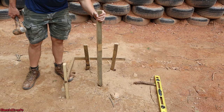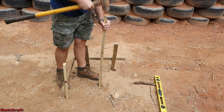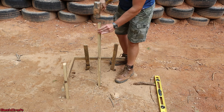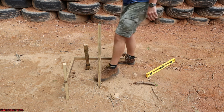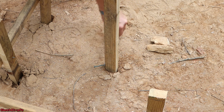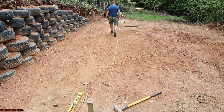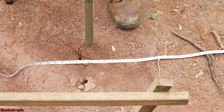Let's go ahead and make sure we have this building measured out and square. I know this spot right here is where I want this first corner because it is 16 feet away from my other building. This doesn't have to be too far in the ground as long as it stays in place while I get the string out. I put a screw on the diagonal of the front corner so I can use this to measure in both directions. Now let's take the tape measure and measure out exactly 30 feet over here to the other side. Looks like my stick was about an inch and a half away from the corner that I needed.